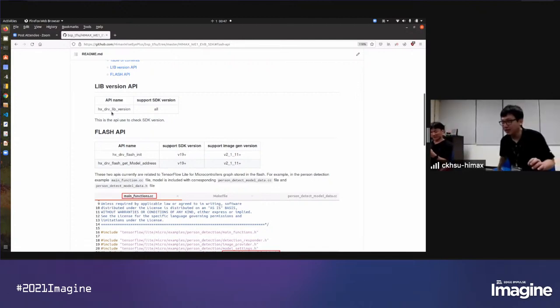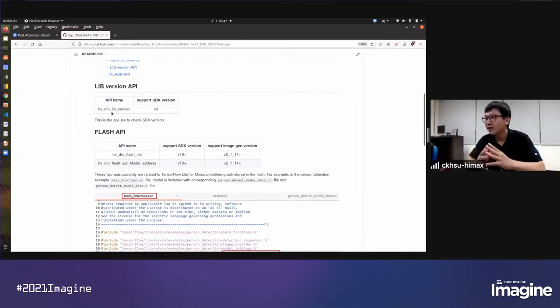Hi. It's a good question, and basically we use the YOLO model. So you can imagine that we split the image into a 5 by 5 grid and a 10 by 10 grid. We have two YOLO layers, one for each. The first one is the 5 by 5 grid, and the second one is the 10 by 10 grid.